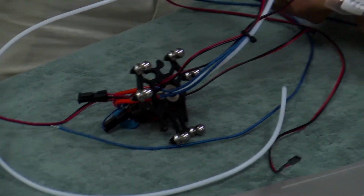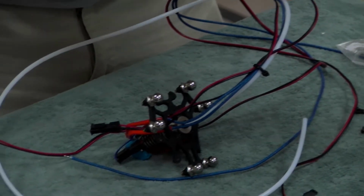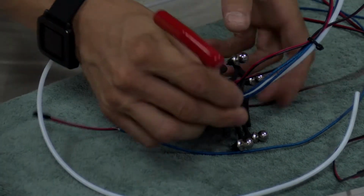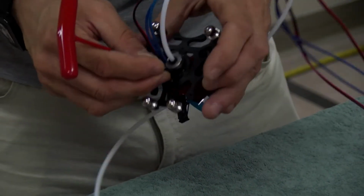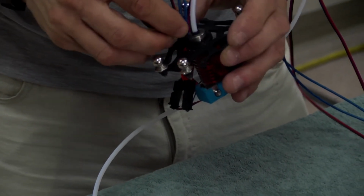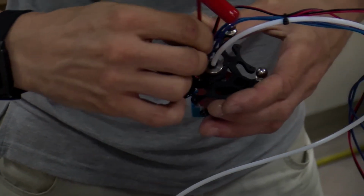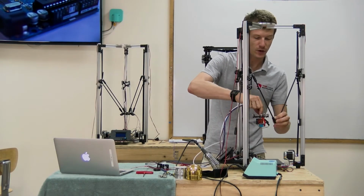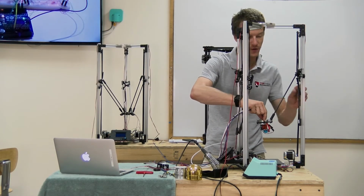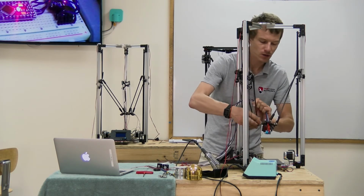Going to use 3 of the 3x8 hot end to effector screws to lock the top of the hot end into the smaller hole. All the wires will run through the larger end. Next, I'm going to mount this and do the fans in place. That'll just be easier for me, but you could screw the fans on the bench.